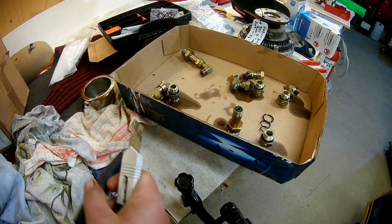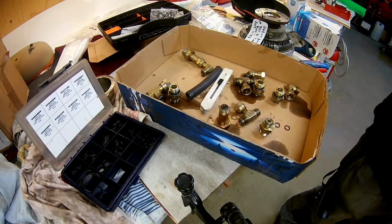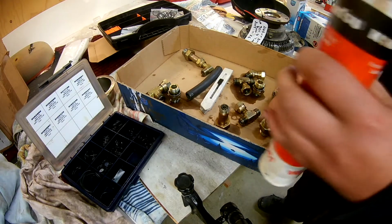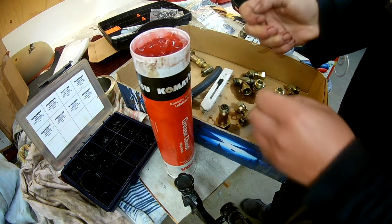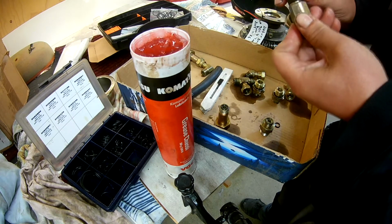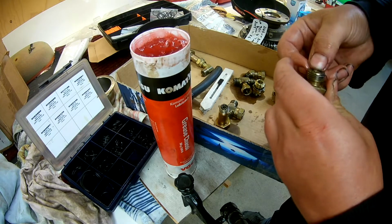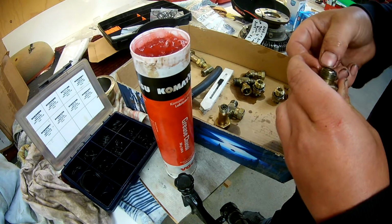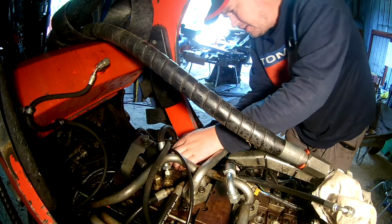Cut a little piece of hose because I am rerouting one of the hydraulic hoses a little, and it goes over a little bit of a sharp edge. A lot of these places had fresh O-rings on them this winter, so I'm not replacing all of them, but a couple fell off as I disassembled, so installing new O-rings for the hoses, the seal of the hose.